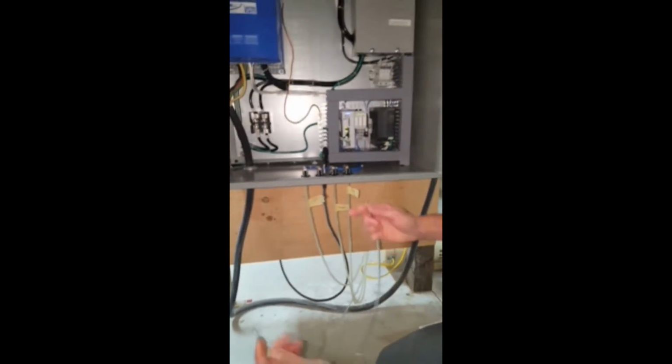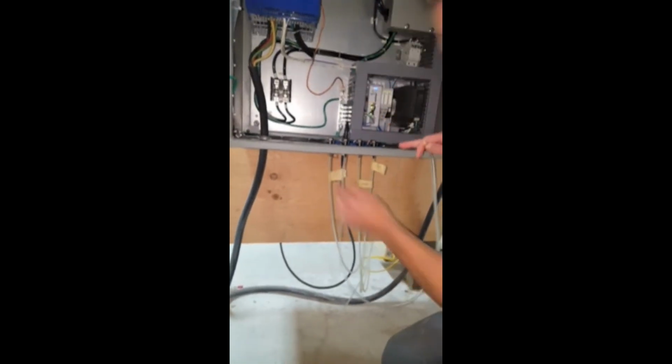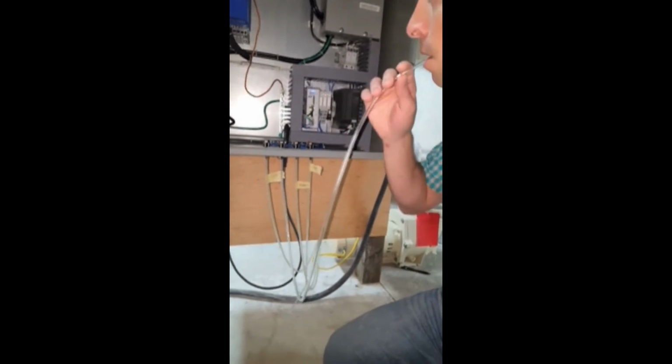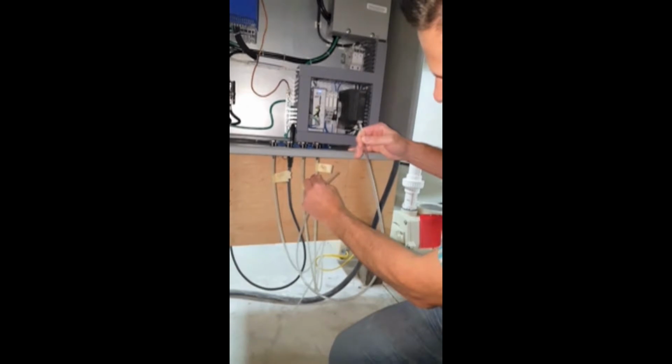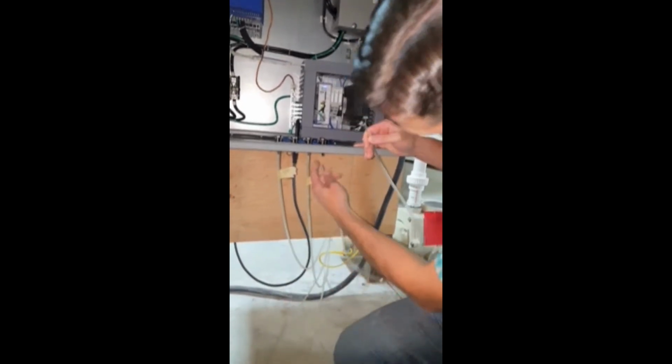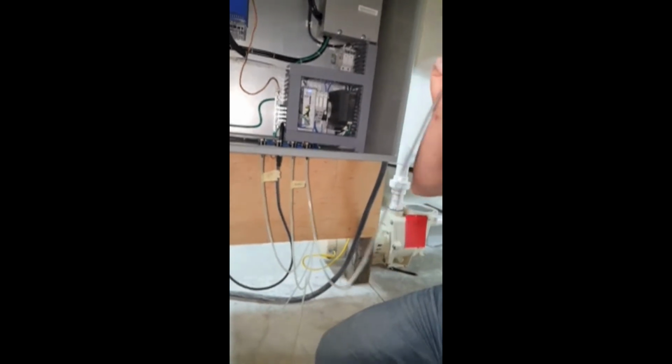And I'm going to go ahead and connect my dummy air tube to the start switch. Okay, next I'll give that one puff of air. That'll initiate a start command. And then I'm going to disconnect my fast air tube and connect my dummy air tube to the fast switch. I'll then go ahead and pulse this.